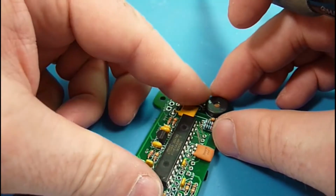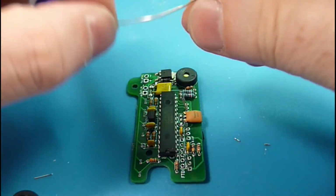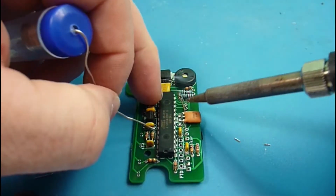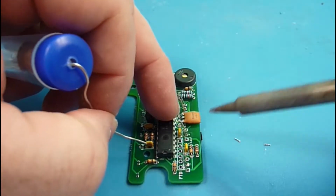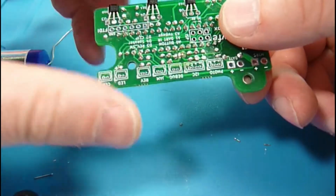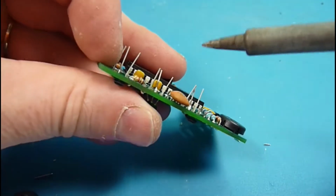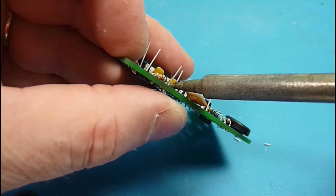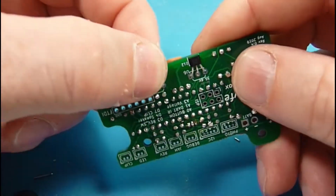But in addition, they have a special feature for power saving, where they'll only check the settings about every 100 milliseconds, which they're designed for like checking if a laptop lid opens. And so 100 milliseconds on the human time frame is pretty rapid, but for the fidget spinner, the rotations were much faster than 100 milliseconds, so that didn't end up working out okay. But we ended up using them here.